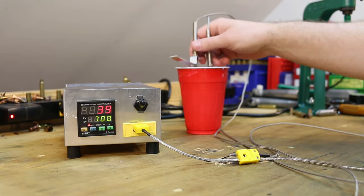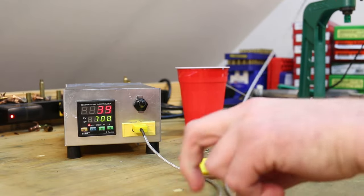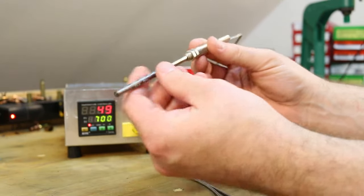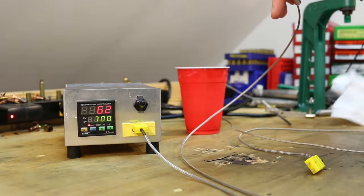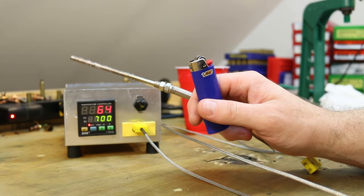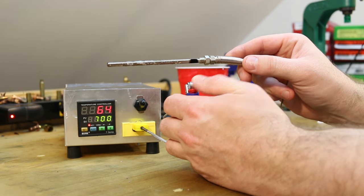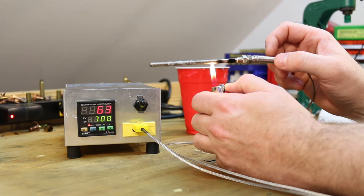Here's my question — I don't know anything about thermocouples, and when I watched Elvis Ammo's video my first thought was: which part of the thermocouple is actually taking the reading? Is it only the tip or is it the whole thing? The quickest way I can think of testing this is with a lighter. If I put fire back here at the base of the thermocouple — absolutely nothing happens. Still saying 64 degrees. So let's work our way out toward the tip.